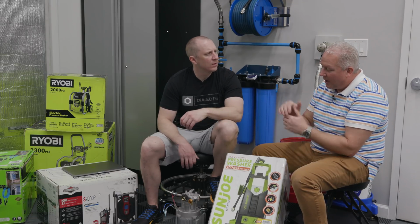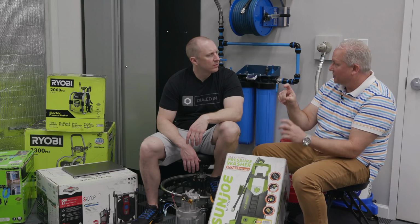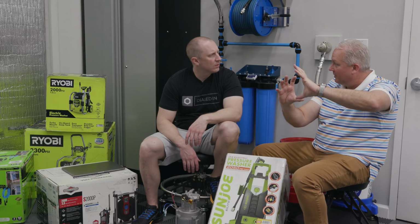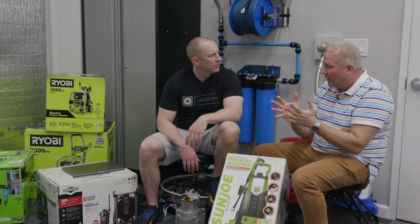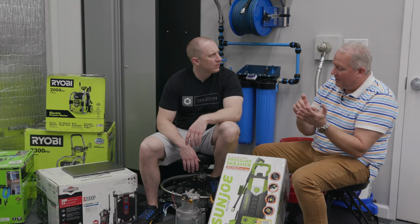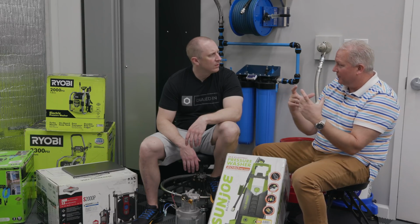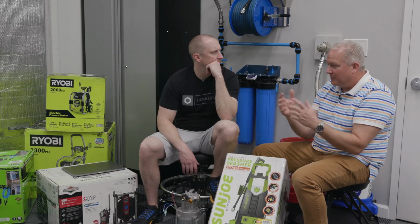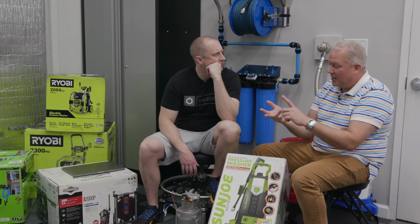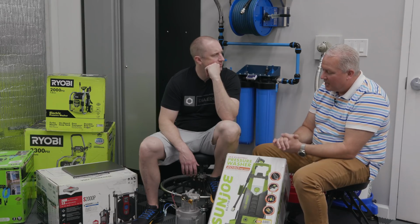Pretty simple. But let's say there was a malfunction in that total stop switch, right? That pressure can then spike and be trapped in the head. So that's why UL requires that you test at that pressure, and the machine is either not going to fail or it's going to fail safely, right? What they mean by fail safely is there's not going to be any risk of fire or electrical shock or personal injury. So it should fail safe if it was to fail, right?